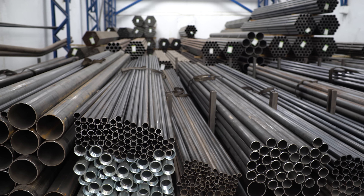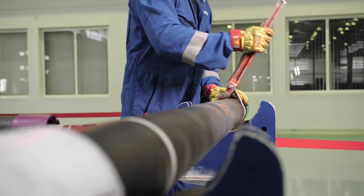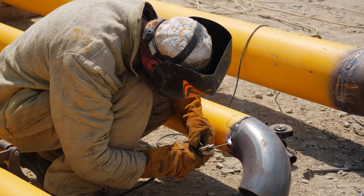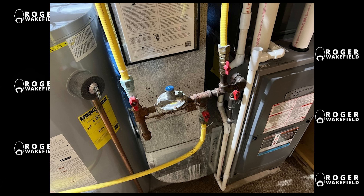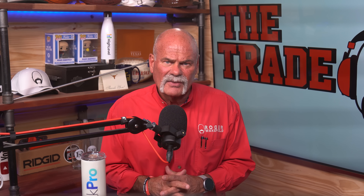Let's talk about understanding the materials and their proper uses. There are a few options. Black iron pipe is the most reliable — it's classic and reliable, but it's also heavy and requires threading. Once you get into bigger gas lines, it's even welding. There are also newer products like CSST, the corrugated stainless steel tubing. It's flexible and very easy to install, but you've got to make sure it's properly grounded and installed according to the manufacturer's recommendations and local code. Most CSST manufacturers require that you have a certification stating that you know how to put their product together.